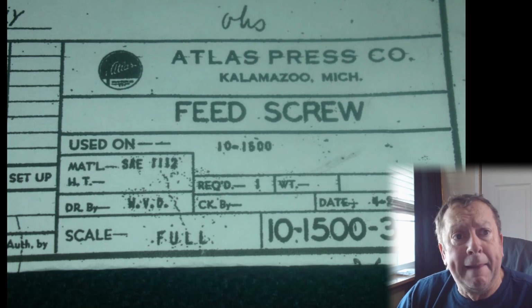I don't believe I have this print, but a call to Clausing will normally get you this print. Let's go back and read the description on this very quickly. These are a custom build. New USA made 10-inch Atlas lead screws for the quick change model 10-inch lathes with 3/4-inch lead screws and power cross feed. Exact fit. Comes with a new nylon locking nut to replace the old double nut setup. Expect 1 to 3 weeks delivery, made to order.